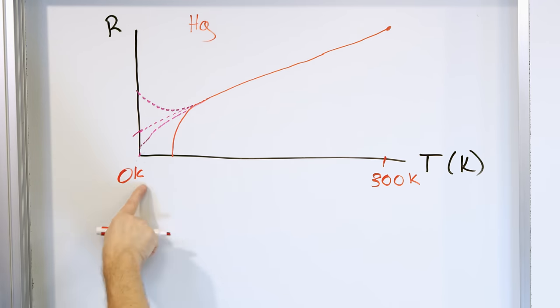So what you have is the magnetic field for the most part being expelled from the superconductor. But then if there's a defect right here, then maybe what you have is, let me get to my picture so I can make sure I draw it the way I want to draw it. Then maybe right here, the flux can penetrate right in this one little defect zone, something like this. And then maybe there's another one right here where the flux can be concentrated and just make it through this one little zone, which is not really superconducting.